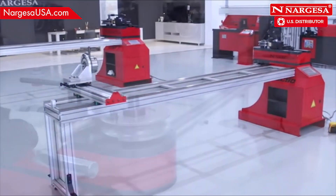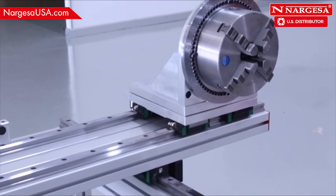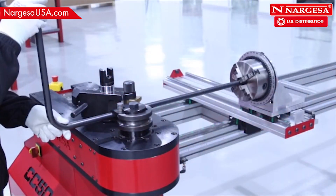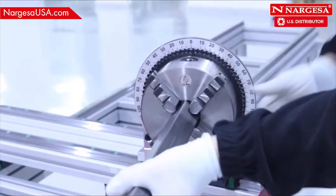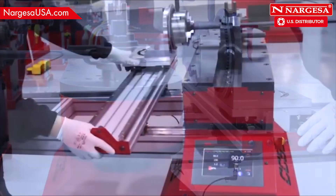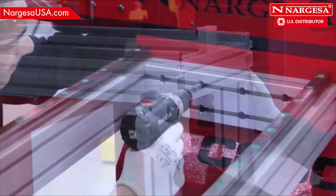Prada Nargessa presents the all-new two-axis positioning gauge for CC60 and CC90 pipe benders, which makes it possible to produce serial parts faster with more precision and repetitiveness. Features include adjustable longitudinal positioning with six positions, angular head rotation every five degrees, adjustable four-hook tray for round and square pipes, longitudinal movement with high-precision linear guides, and automatic anti-collision control. All limit stoppers are manufactured, assembled, and inspected at their facilities.